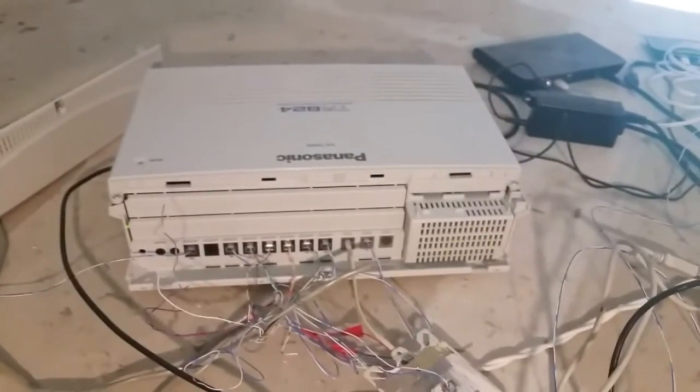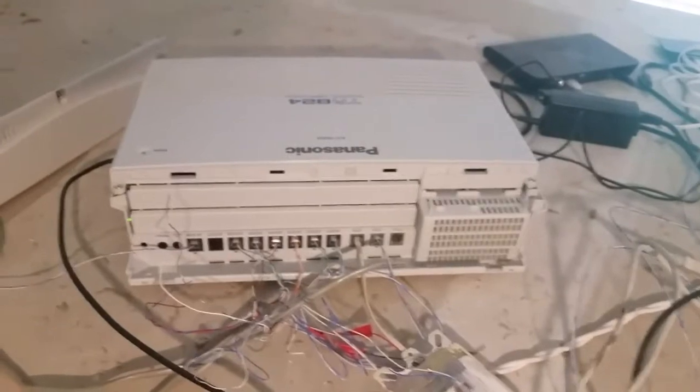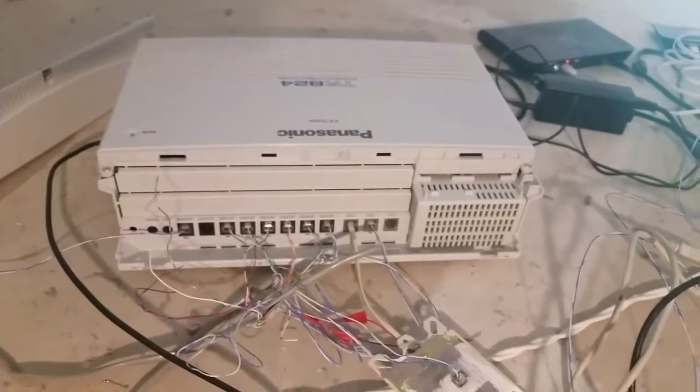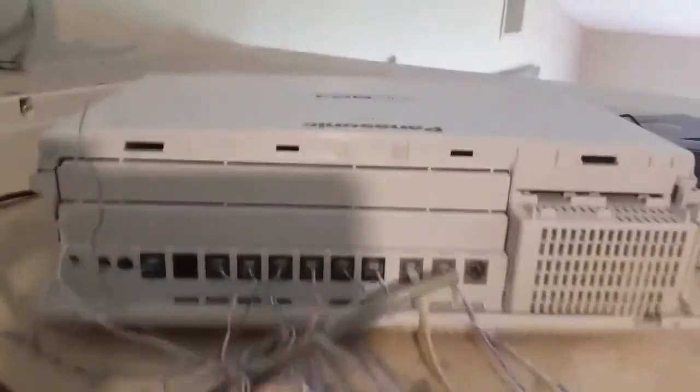The programming is really simple — they actually work just fine for rotary phones right out of the box. Basically with this PBX system it'll support pulse dialing, which is one thing MagicJack doesn't support — they only support tone dialing. It also generates enough electricity to ring the bells and ring mechanical ringers.